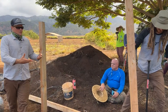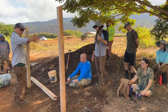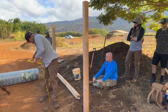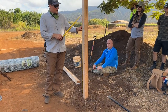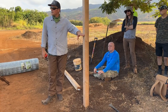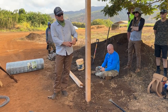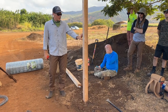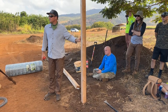An H-brace is like your common pulling point. Now we're going to put our H in. This fence in particular is I think 47 inches. So 47 inches is here — this is the top of our fence. Which means our top strand barbed wire is going to usually be like about three inches above that. The way I like to do it is I like to put my H or my cross piece right around the top of where that fence is going to be.